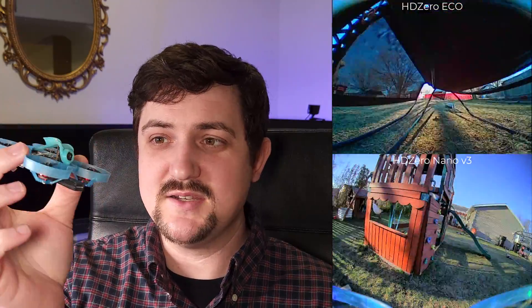This is a lot like what we get out of our lighter-weight Mobula with the RunCam Nano 3 camera, but at higher resolution and a much more stable picture. The main thing I notice is there are no brightness flickers like we get in analog — it's very consistent, which is nice on the eyes. The other thing is that the analog signal is interlaced video, which can cause stair-stepping on jagged edges. If I wasn't using the HD Zero goggle, the video wouldn't be as nicely de-interlaced.